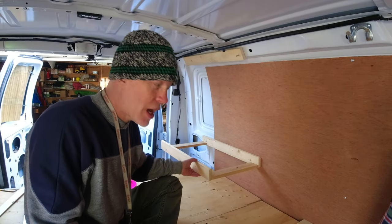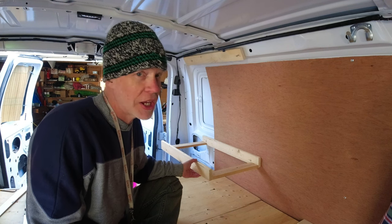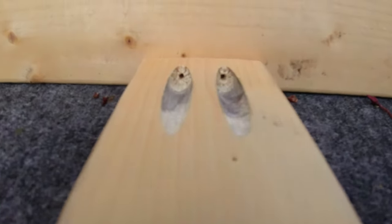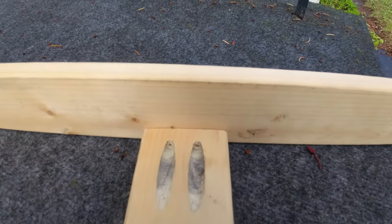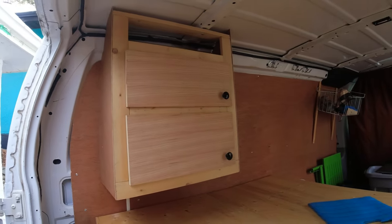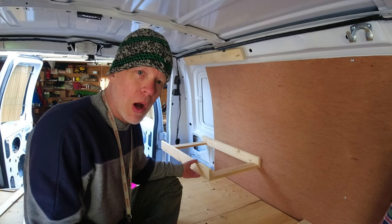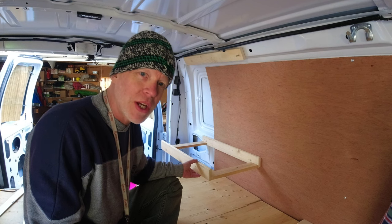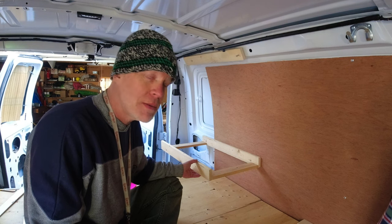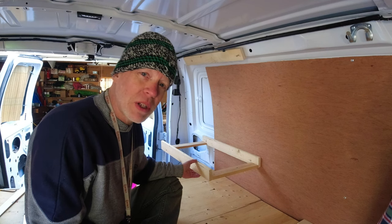It's taken me a while, but I've got the cabinet base formed. Now that we're into building the actual stick frame of the cabinet, this is where we start utilizing pocket holes and pocket screws to connect the individual pieces of wood to create ultra strong joints. Each joint will have two pocket holes. I'm making sure to drill the holes on the inside of the frame so that they are hidden — this is critical on the front side that won't have any paneling. The first pocket holes I drilled ended up splitting the wood, so I had to recut some new wood, and now I think I've got it nailed.